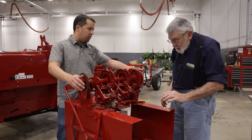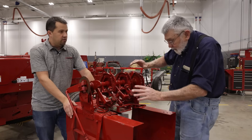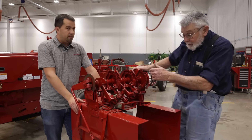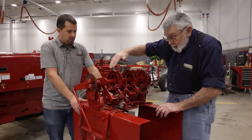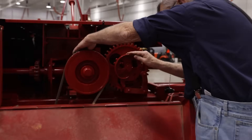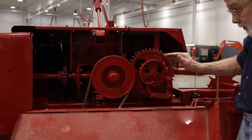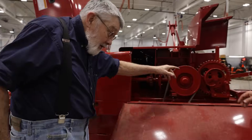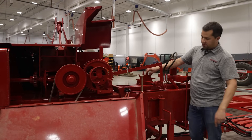Where is this driven from? This is an older, real old baler case. The new balers all drive off from this side. The older balers — 273 and like that — actually had a chain that came here and drove this. The new ones have a gear drive, actually a worm gear on a shaft, that drives it. That's hooked up to the flywheel. The flywheel drives this chain, the chain drives the shaft, the shaft goes back and drives the knotter frame. So there's nothing in the knotter that's moving until this is tripped.